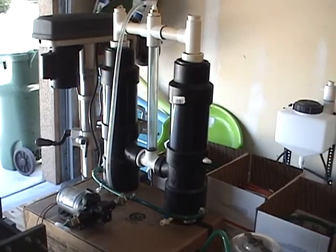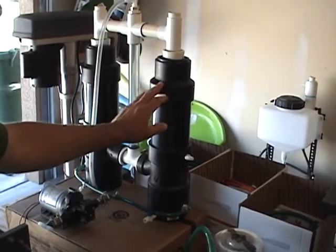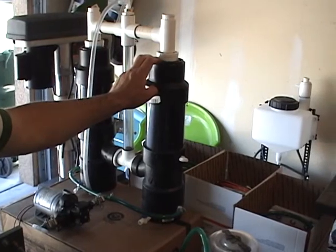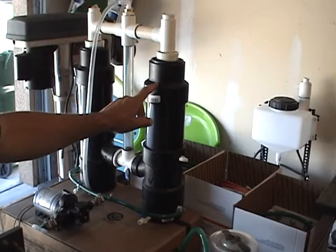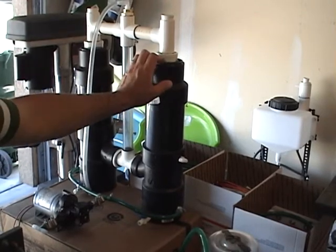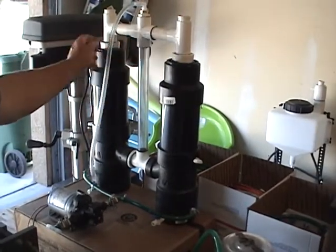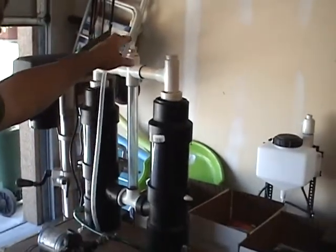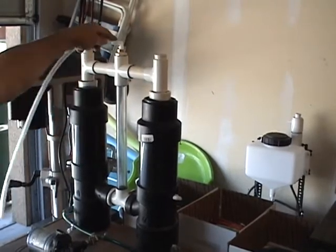One of the reasons I built this is that we've got both sides filled with bronze wool, but looking back at that I would not do that again. I'd go ahead and put some stainless steel wool in here instead, because the bronze wool doesn't react very well with KOH. That's in both sides so that I don't get any sloshing and any electrolyte out through the top. This is the outlet for the gas.